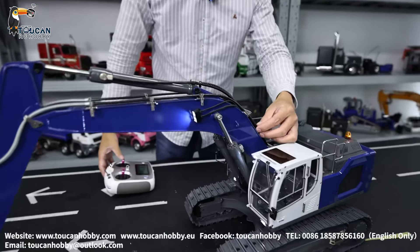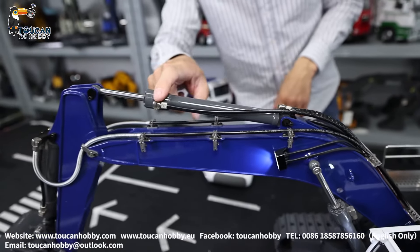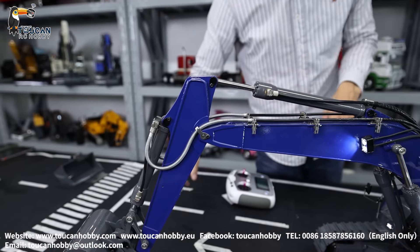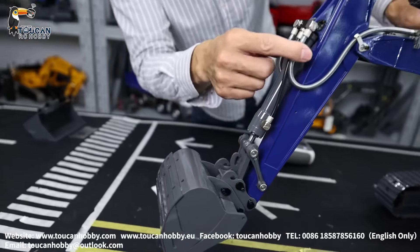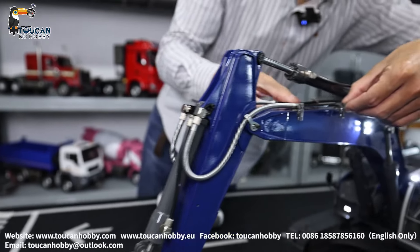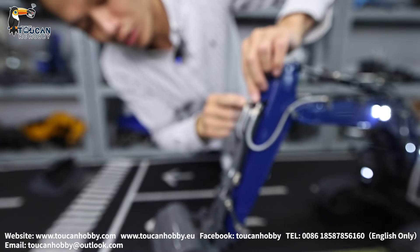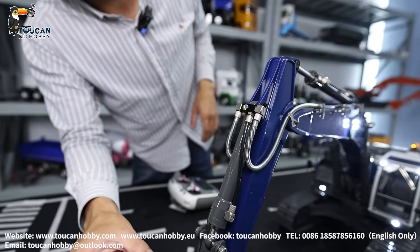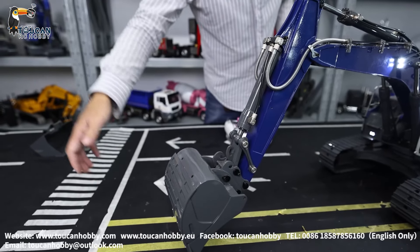Here are all the holes for the other two channels. One is the front arm cylinder — in, out, depending on whether you go out or pull it back. And here is the cylinder for the bucket. This oil comes in through two holes, all connected to this middle one, so more oil can come in more quickly for opening. And more power for digging the land.